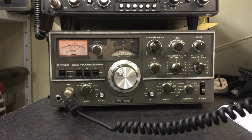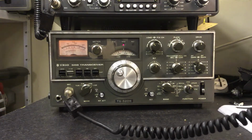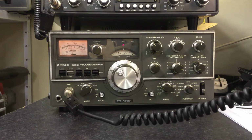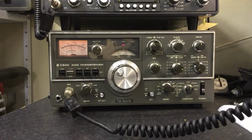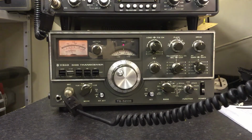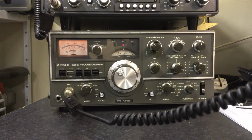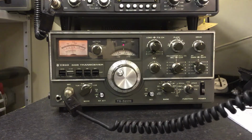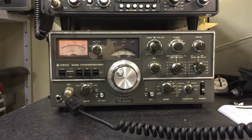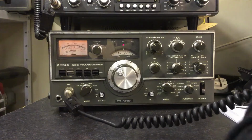The antenna itself is a 90-foot long wire, about 25 feet over the ground, and in an inverted U shape, so the majority of it is horizontal over the ground, and then I've got vertical elements at each end. And when I say elements, you know, just an extension of it, with a 9-to-1 unun coming into the garage where I've got all my big old heavyweight rigs there, Peter. Hope you copied that. Back to you, G4 YCA M0 JCF.